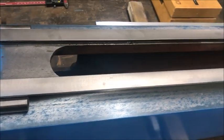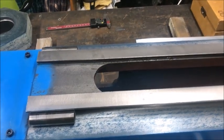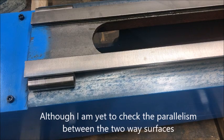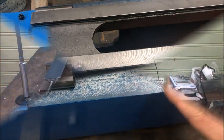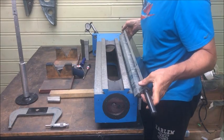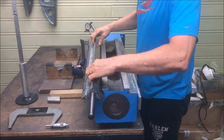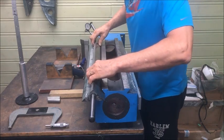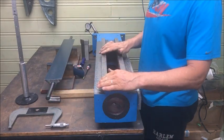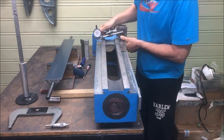I blued up both the column ways and the same on the opposite side. It touches almost all over, so that means this quite rough milled surface only needs a touch-up with the scraper — it's flat indeed. My take on this is to use the straight edge to measure up these faces the normal way: scrape where needed, when needed, ensuring parallelism and alignment.